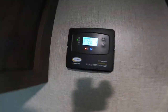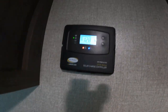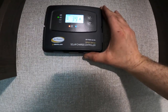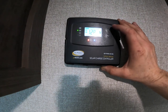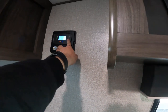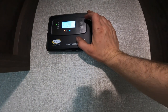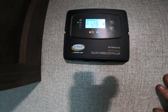Next we're going to take a look at the head unit of your solar power system. This head unit is connected with the batteries out front, which are also connected with the solar panels on the roof, and it will indicate your battery levels. You can switch between amps and amp hours — currently showing 2.1 amp hours and 12.8 volts; not fully charged as you can see. It also has a light indicating charge level. This basically gives you a way to monitor battery power and levels and to make sure it is charging appropriately. The indication lights show it is both putting out power and charging.